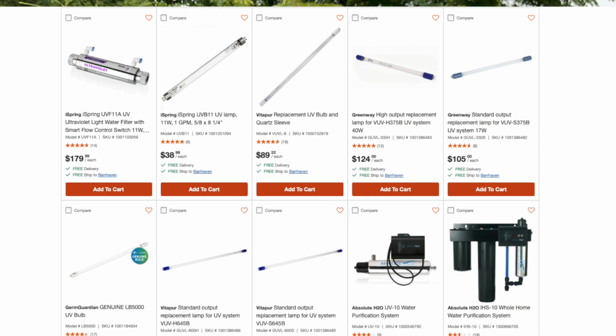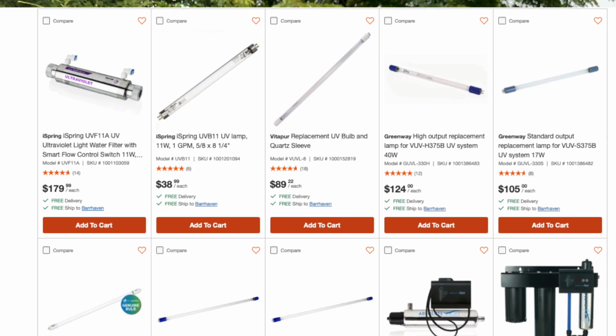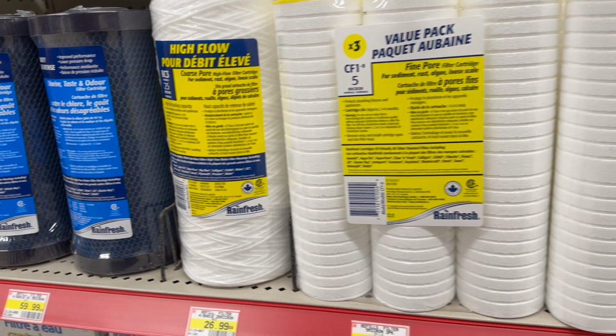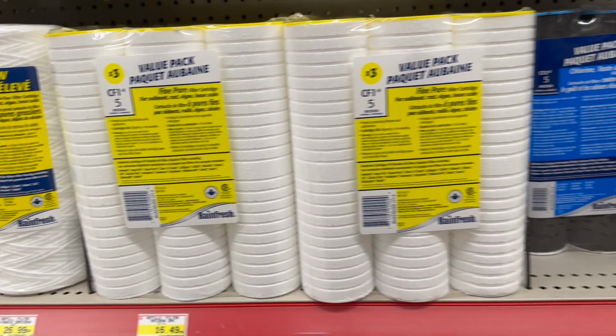We're talking usually a couple $100s for a homeowner per year to replace the lamps. And then throughout the year, it's just visual inspection and keeping that system clean. An indirect cost might be the cost of replacing the filters to make sure that that water quality stays stable. That's pretty minimal cost just to achieve the disinfection. But for the UV system itself, really it's just the annual lamp replacement for a few $100s.